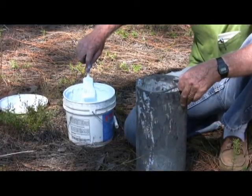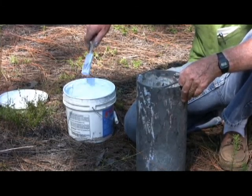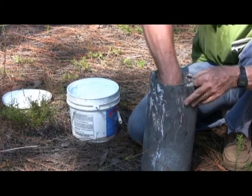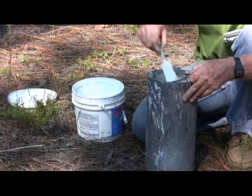The steel crucible must be protected from heat and corrosion by molten metal by painting it with boron nitride, a material that is not wet by molten metal. The crucible must be recoated with every use.